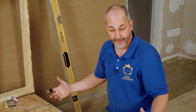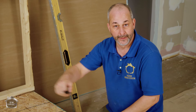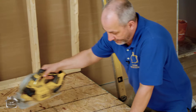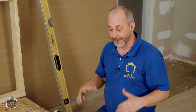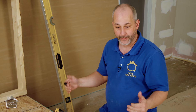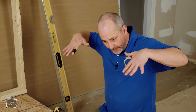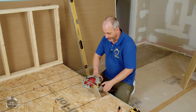Another simple option if you're opening it up is to cut out the whole 4-foot width and then just cut down the sides. When you go to reinstate the plywood it's really not that tricky - it's tongue and groove, so you just cut the bottom part of the groove off so you can stick in the tongue, set it in place, and screw it down. Now when it comes time to actually do the cutting, you're going to want to take your saw - always take the battery out of your tools before you mess around with them.